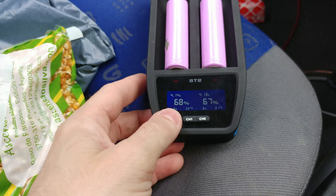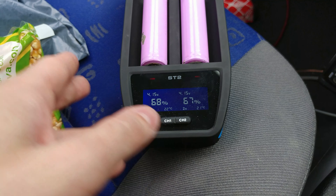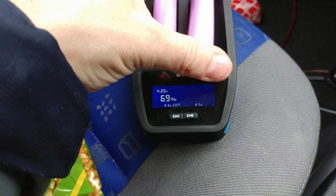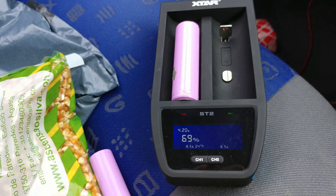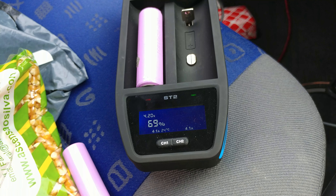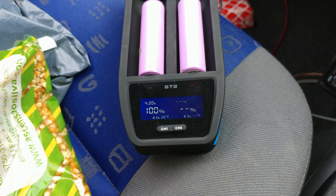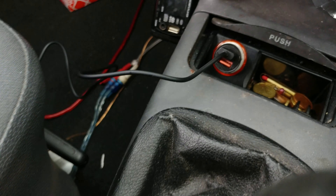If it's still at 4 amps it will mean this device is actually providing as much as it should. Look at this — we are just getting 2 amps per cell, but that's not bad anyways. What happens if we get rid of one of them? It is charging one cell at 4.1 amps. Just 2 amps with both plugged in, but that's not bad anyways.